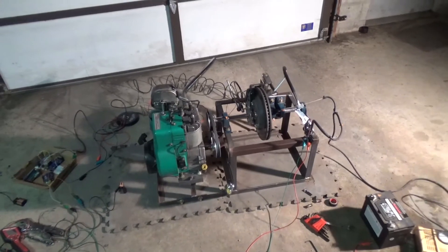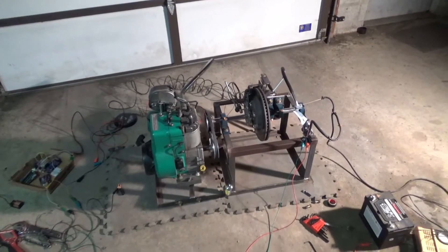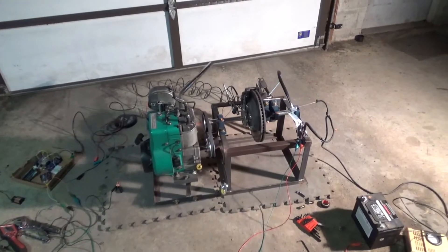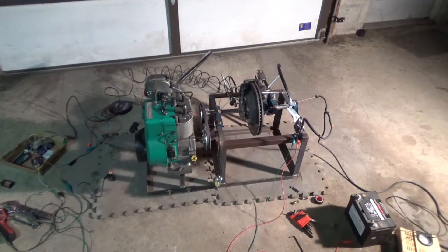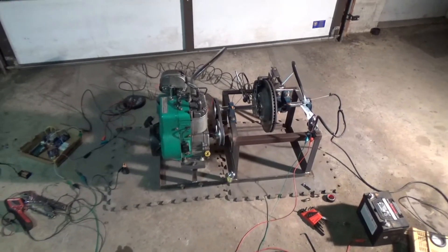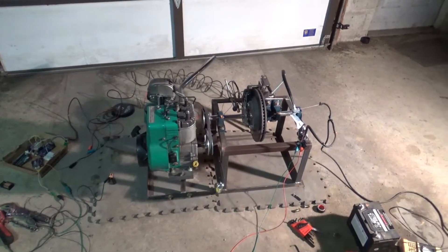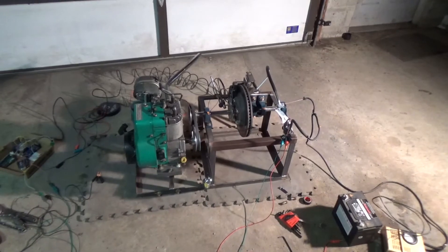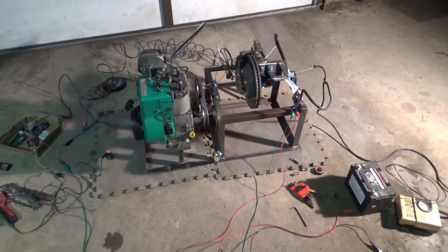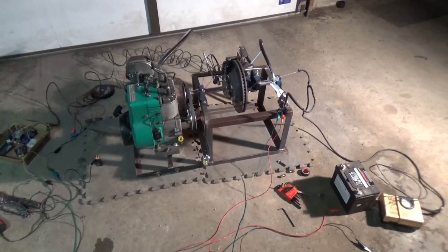At that point, you can just put in different curves for different engines. Like, once I supercharge this engine or go EFI or whatever, if it's making a lot more power, I can just change the automation curve and it'll change the brake apply automatically. That way I don't 'drive through the dyno,' as dyno operators say. Anyway, thanks for watching, and here is the dyno in action.